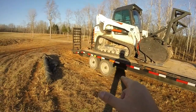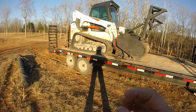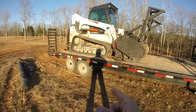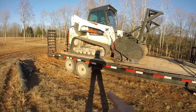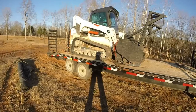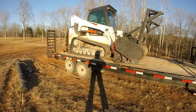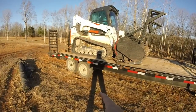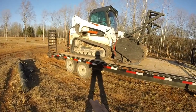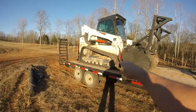The rims on it are super heavy duty steel, and they're heavy duty equipment trailer tires. I think these are 10 ply tires plus sidewall plies, because I'm always driving on people's lands or on their farms. It's unimproved, rocky, with sticks, whatever. So just to avoid punctures in the tires from debris on the ground, rocks or branches, get a good set of tires.